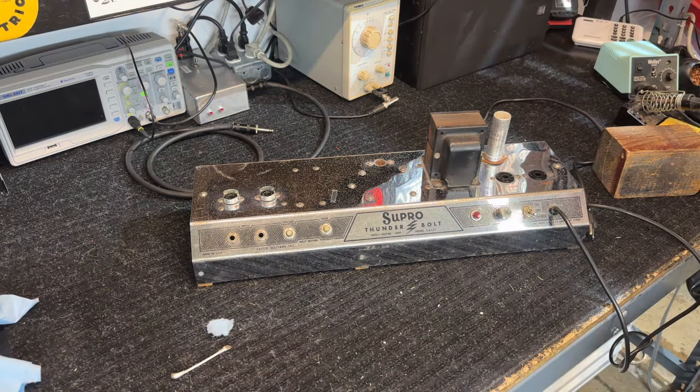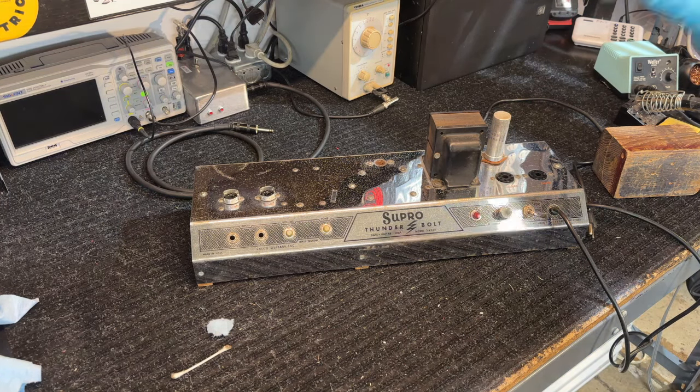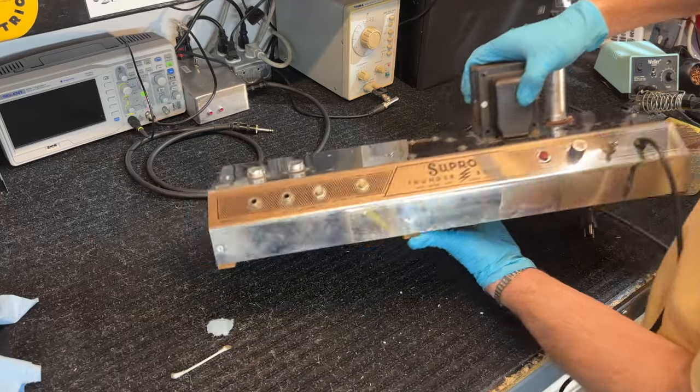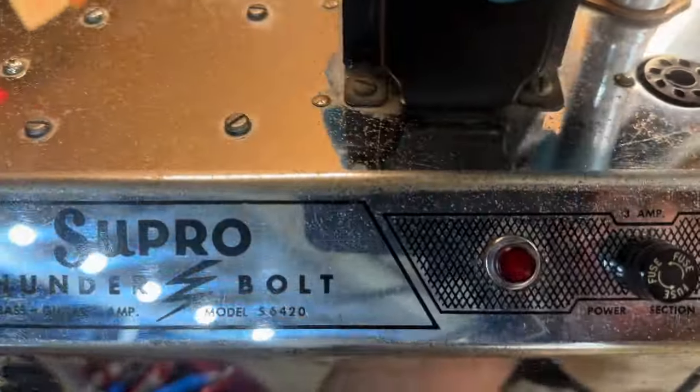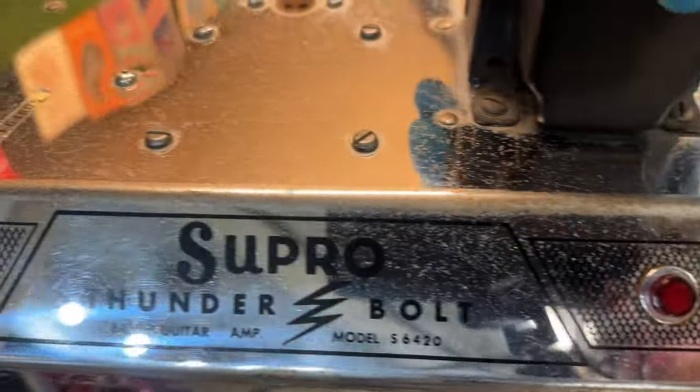I also wanted to mention the reason why we didn't change the electrolytic can out is because we would have had to have had that custom made for us. The client was in a hurry to get this into a studio for tracking, so we went with discrete capacitors.